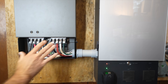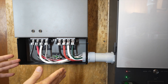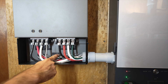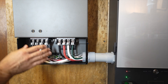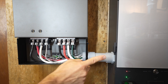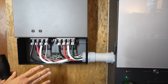Now let's talk about the significant differences. I have the power shut off so this is all safe, and I'm running the house loads on the Smart Home Panel 2 off of the Delta Pro 3. The Home Power Panel is pretty unique — its biggest distinctive is that it's an AC-coupled device. It connects through a breaker, in my case a 100-amp breaker on my main panel, and it comes with current sensors that you install on the two wires coming in from the power company. When you turn on a savings mode in the app, it tells the inverter to sync with the power company, increase the voltage slightly, and that causes power to back-feed into your main panel — what I call local back-feeding — providing power to all circuits in your home without moving any wires.